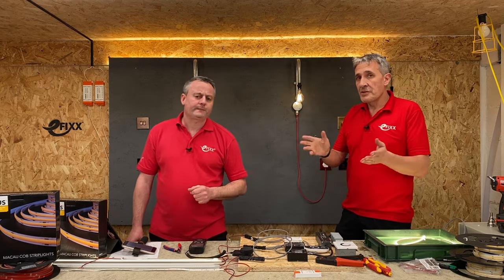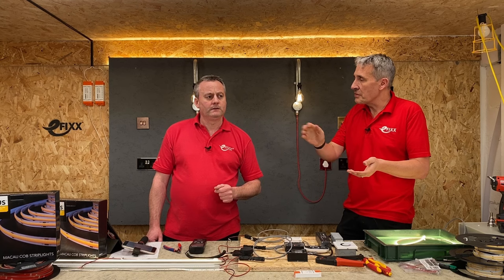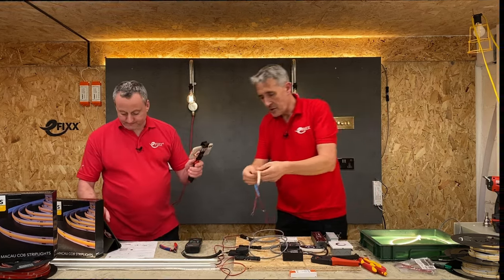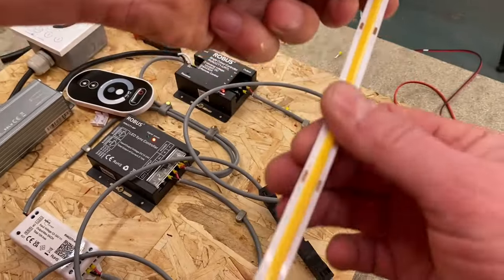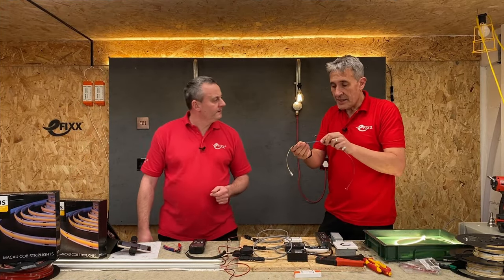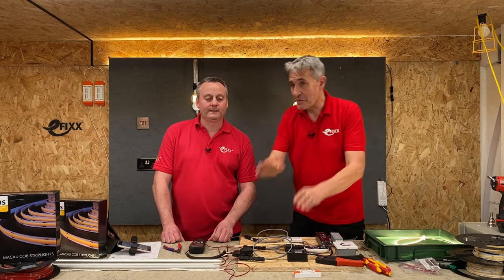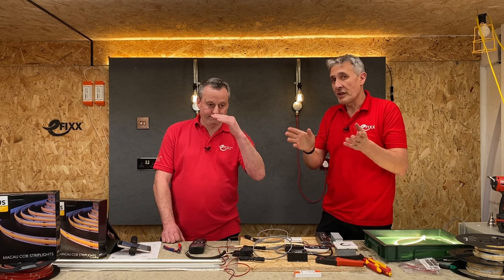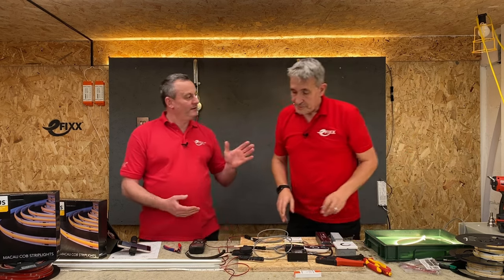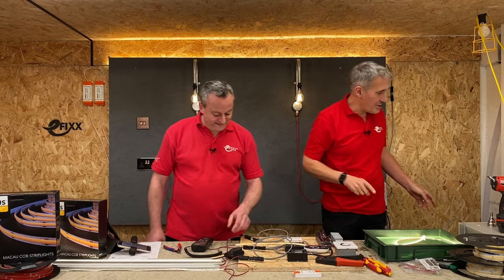When we start thinking about light levels and the ones where the chips are seen, we often put a diffuser on the top — what's the effect? Quite a significant effect. People use a diffuser for two things: sometimes environmental protection, so you don't want the LEDs to get damaged — on the discrete solution you can go along cleaning and damage the LEDs. The good thing about the IP20 version I've got here is that silicon coating across the phosphor — it's very smooth. You possibly don't need an extrusion for mechanical protection, though we'd always suggest one to manage heat and increase longevity. Sometimes people use the extrusion with a diffuser to get rid of the dotting effect.